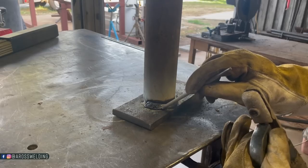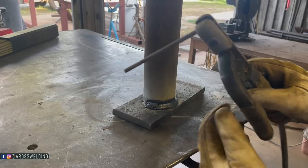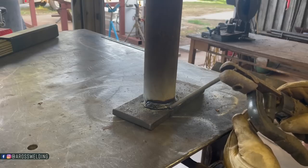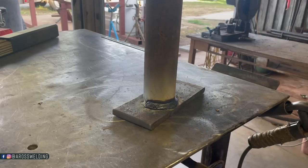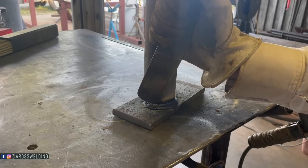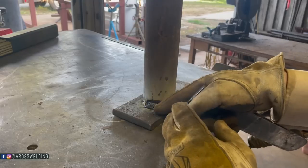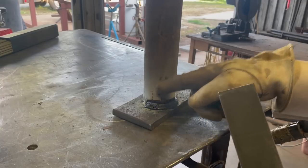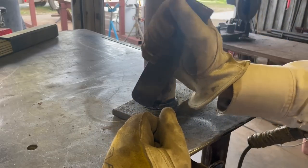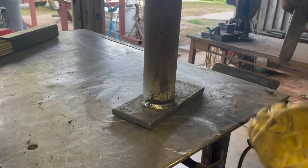If you just focus on your fingertips in your stinger, you can literally feel it. Wherever you touch the edge, you can feel your welding rod touching the metal. That's actually something I learned on pipeline — downhill welding can get a little hairy in a tight bevel, and you learn to just move your rod back and forth no matter what the slag is doing. That pretty much reassured me I was tying into the metal.